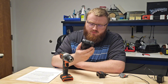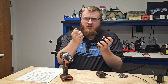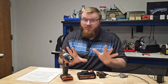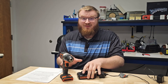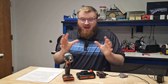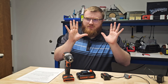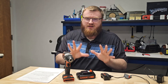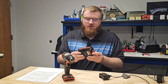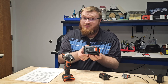One major concern I have is the DC adapters that go on the battery pack and provide two wires out so you can use drill batteries in whatever project you want. The problem is that now you don't have any safety for the pack outside of the built-in overcurrent protection. You no longer have the low-voltage disconnect of the tool, and you no longer have the safety of the charger — especially if people decide to plug it up to whatever to charge it. The architecture I'm not a fan of, but like this, I'd consider it safe. Throw one of those adapters on it, and you've just bypassed everything the system does and put the battery pack at great risk.